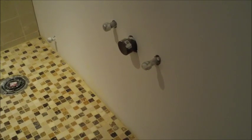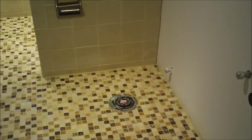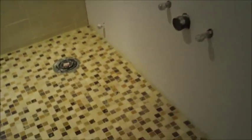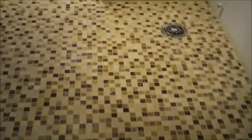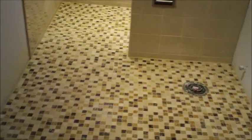I think tomorrow we'll get the stub outs changed, get them all set, and get the shut-off valves mounted for under the sink. We'll get the stub out for the toilet changed out — that's a little more visible in that location. I have one stainless one or I might use it for the shower head. I'm going to ask Jen to investigate what we need to get that shower head mounted up. It was a short one today but I'm in a great mood because it hasn't been a 10-hour day. I'm really happy. Thanks so much guys — in about two hours we've grouted this bathroom and we'll be all set to seal her up tomorrow morning.